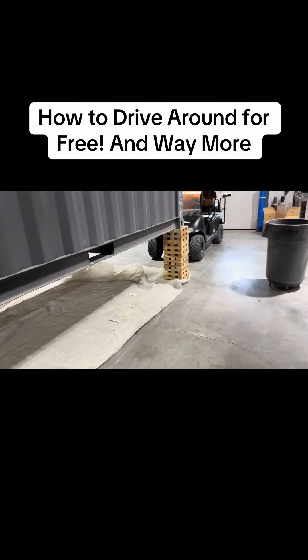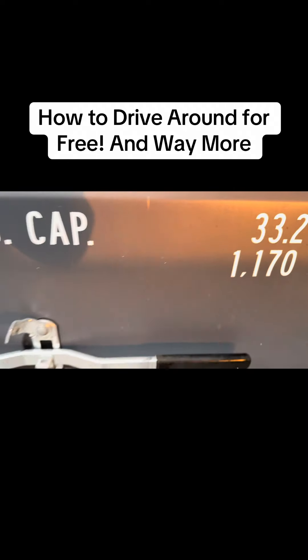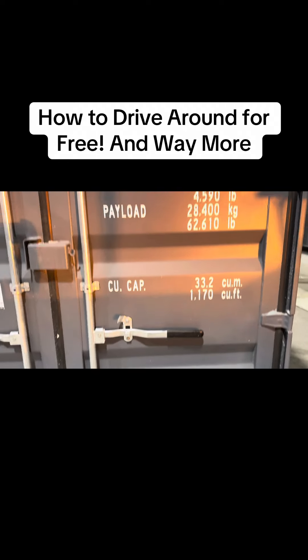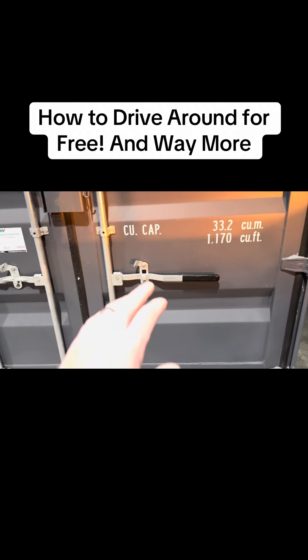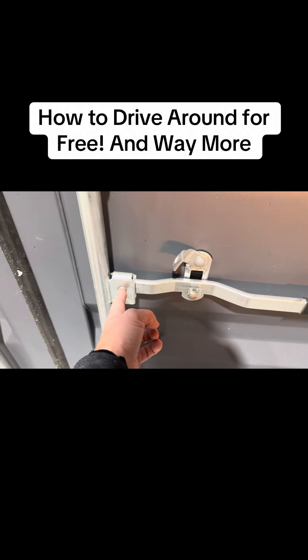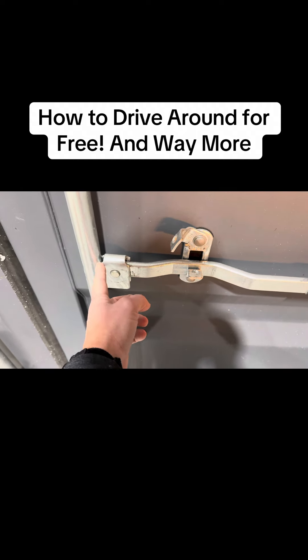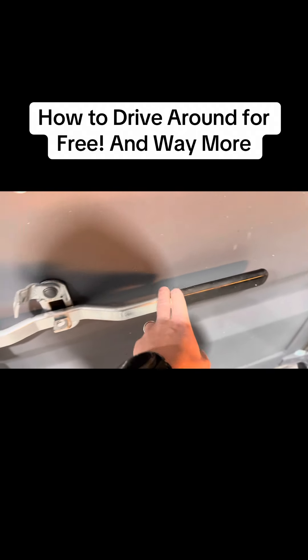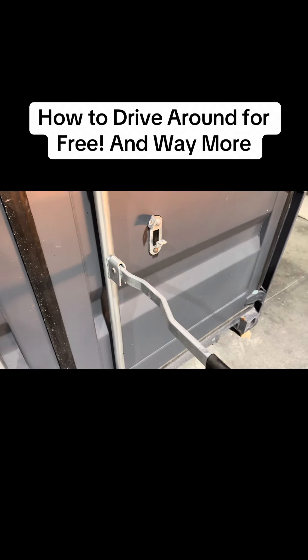Here's the finished product — let me open a door. It's got a little bit of light. If you guys buy new containers, just get the easy-open handle. We actually convert a lot of used containers to the easy-open handle. You can cut or drill the rivet out and put a bolt in, or cut the easy-open handle off right here and weld the new one on.